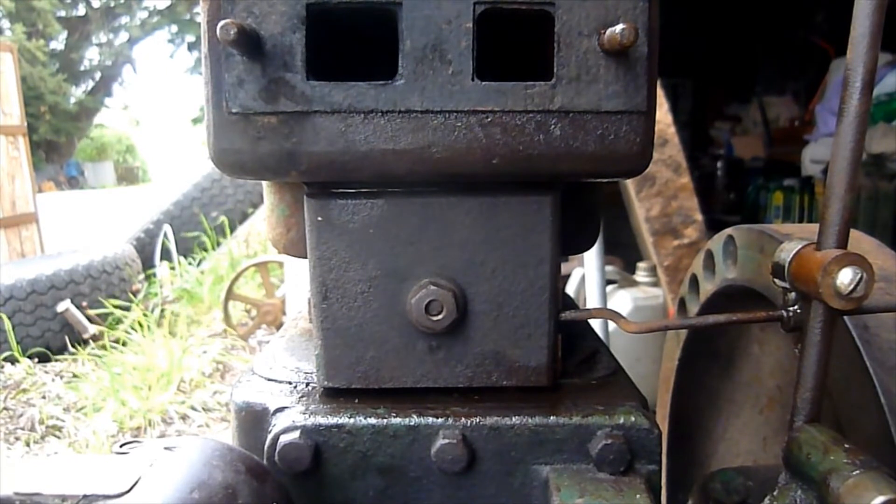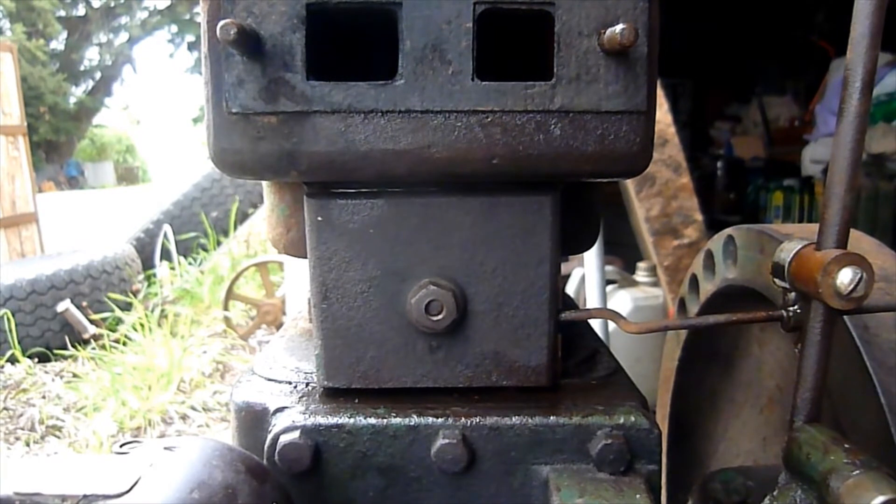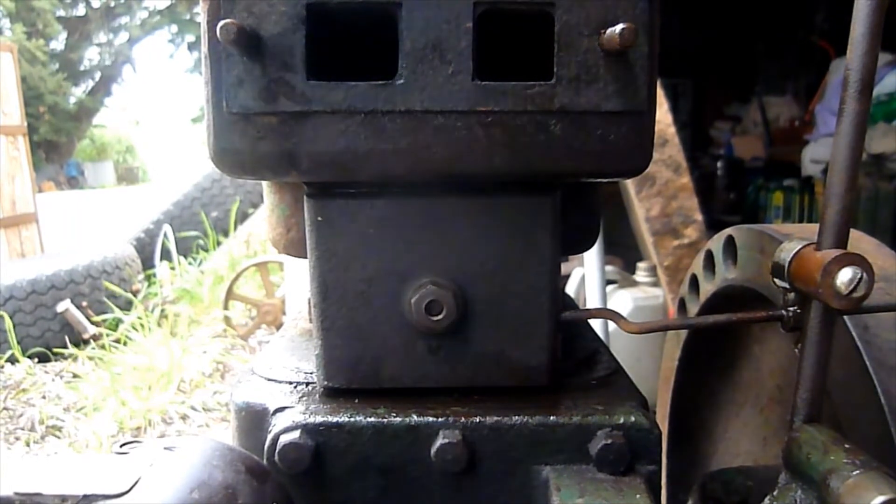It's actually surprising how few people out on the rally field will pick up on this modification. To confuse even more people, I've removed the butterfly from the throttle assembly and left all the throttle linkages in place, so it just looks like you've got a small extra linkage here. A few people will make comment on how rough this runs for an N-Type, when they are quite a smooth running engine as a throttle governed engine — but it's hit-and-miss, that's how it's meant to run.